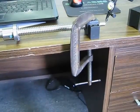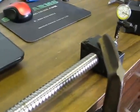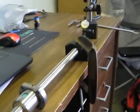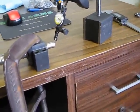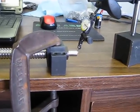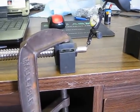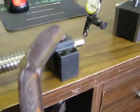Here's the super sophisticated fixture for the RM2005 ball screw with the BFBK holders on them. These things are pretty much junk — they need a spacer in between the bearings because the internal races touch each other.